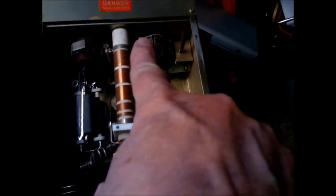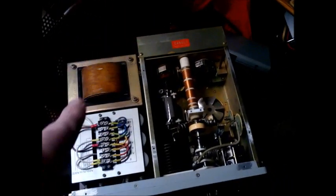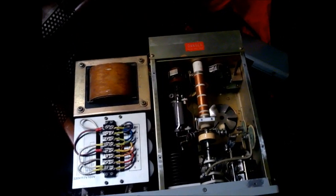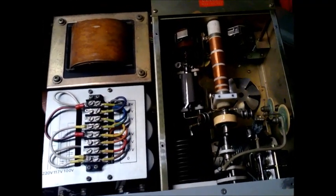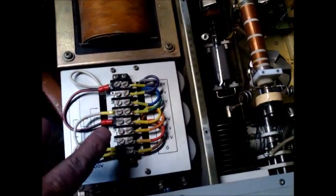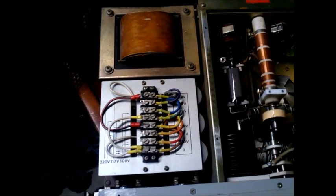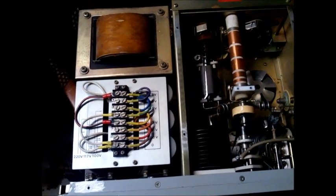We extracted the third tube from the customer's unit. This is a really nice, clean linear. The only problem we had was electrically it wasn't wired right — they had the neutral wired to ground and the ground wired to neutral. Not good. We fixed that and did some other things. Overall, this linear is immaculate. I checked the caps — no bulging on the bottom, no sign of leakage. Plate voltage is spot on, so it should have made full power.